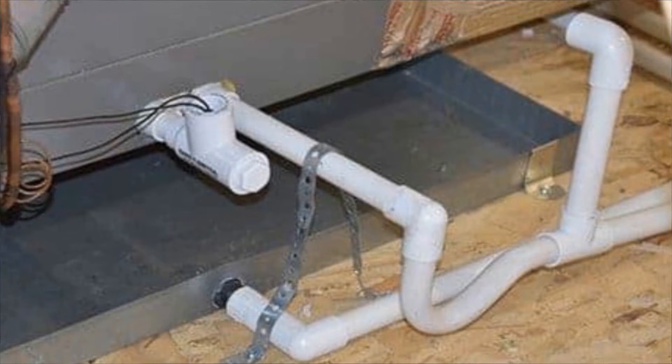A few other things to notice in this picture: you have the secondary drain off the pan, which is good to have. You don't have the secondary drain off the unit going into the pan — something I've seen a lot of times. When you have that up in the attic, it's going to be sucking air through that secondary drain all the time for an air handler, or blowing air out into the attic for a furnace with a blow-through coil. Either way, it's an efficiency loss, though not that big of a deal.